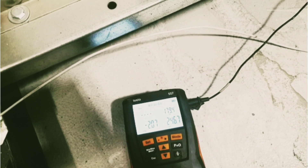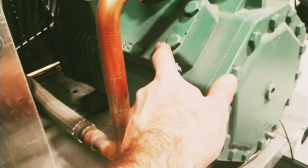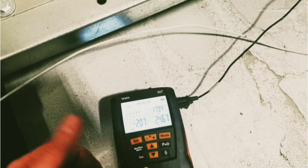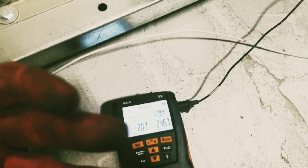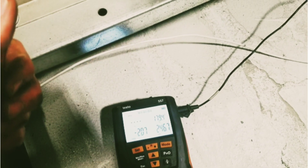If we start to approach 225°F on the discharge line, that's not good — the valves inside the compressor can be up to 75 degrees warmer internally, and oil starts to break down, losing its lubrication film. 225°F is a good rule of thumb: if you're up around that temp, you could have some issues within that system.